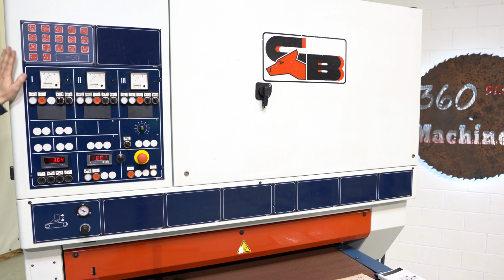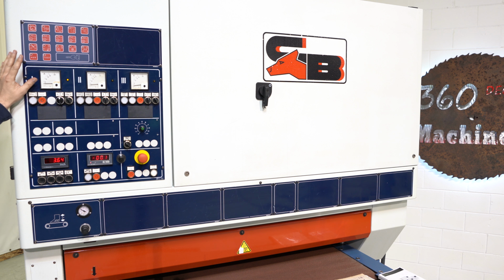Up front, you have your diagnostic area of the machine. It's gonna tell you basically if you have low air pressure, if your belt's not tensioned, or you have a side door open. It's just simply a little red light indicator that comes on. What's nice about this is sometimes operators get safety locked out of a machine and it's just simply the belt's too far over or they don't have something tensioned, and they will spend an hour of your time trying to fix it. It's always nice to have a machine that tells you, and it's pretty much fully mechanical.